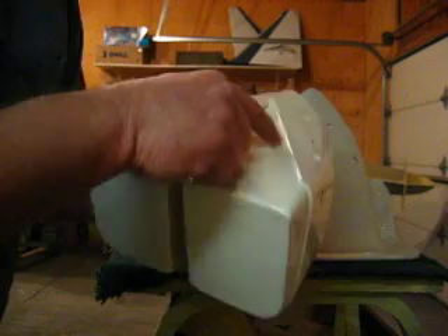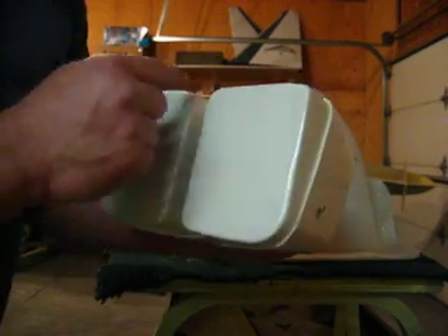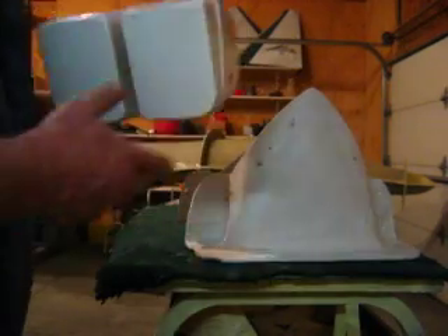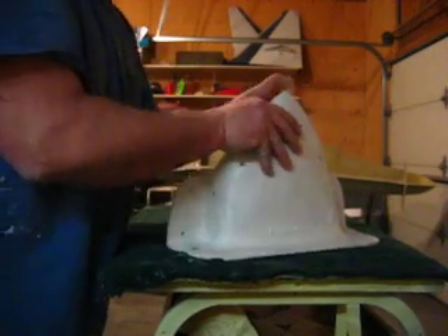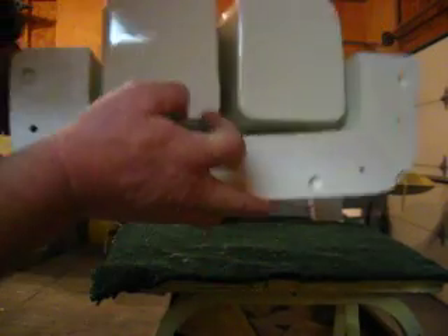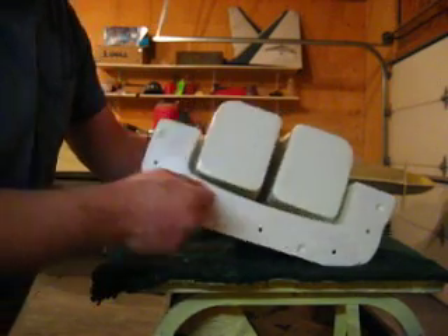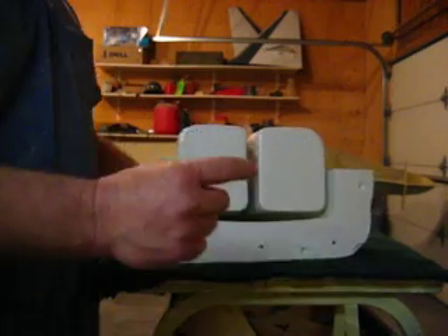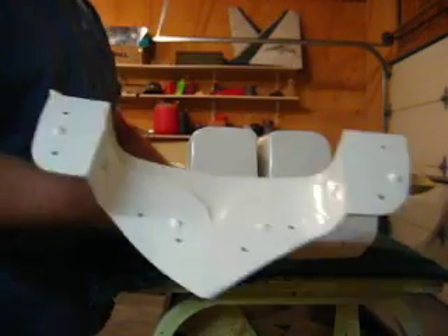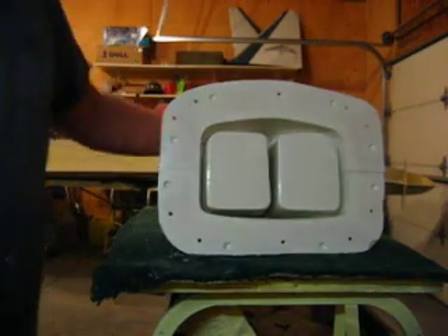Then I can get in there — I'll put a little bit of resin on that edge before I bolt them, then put some one-inch fiberglass tape in there. I'll work that down in there with the coat hanger, then take a brush taped to a stick and get some resin on it. I'll bolt this one to that one, get inside of there, and do the same thing — work that glass in there, dab it with a brush using one of those disposable brushes on a stick. I'll have that all laid up and trimmed, stick that on there and bolt it.